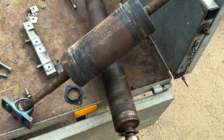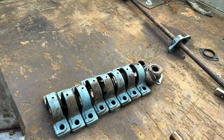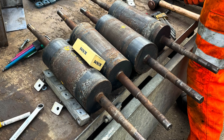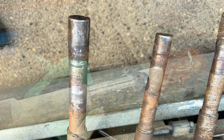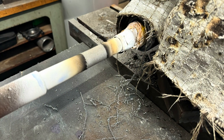Here are the rollers - they were quite rusty as you can see, and some were seized on the bearings. There are the old bearings, and every roller on the drive end was worn, so they will all need to be metal sprayed. You might have seen our other video - I'll put a link in the description - we actually metal sprayed all four rollers and that looked something like this.